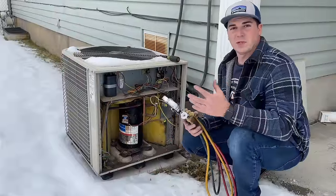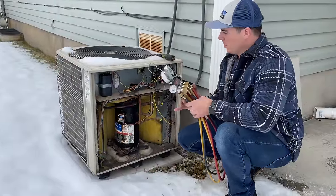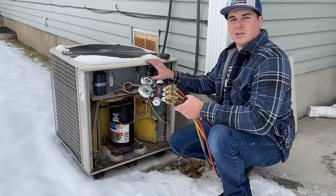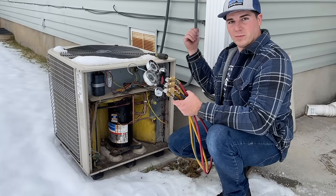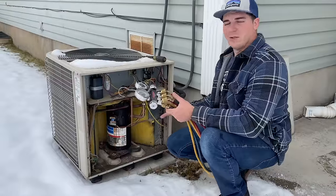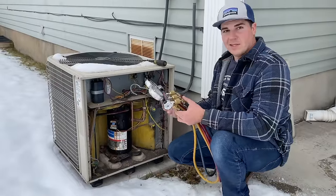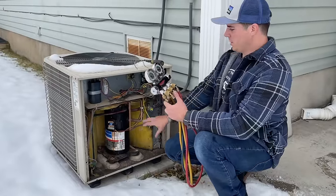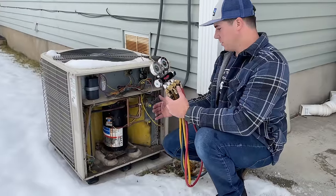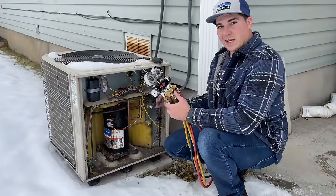Because we are doing a full replacement, we need to pump all of the refrigerant into the condensing unit so we can remove that coil from inside above the furnace without dealing with any refrigerant in the lines. The easiest method is using the compressor to pump all of the Freon into the condensing unit. I'm going to show you exactly how to do that. We're going to start by removing the valve cover on the low side — the low side will be the larger line, probably a three-quarter or seven-eighths line — and we'll connect our blue line there.